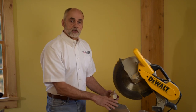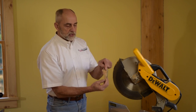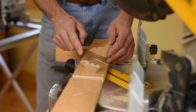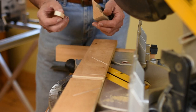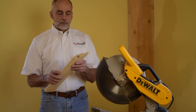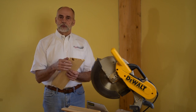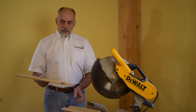Sometimes this is a little hard to visualize because it's a sprung molding. But if we look at this solid crown, there's no difference — if I take this same molding and cut off the back to make it a sprung crown, the ceiling projection is the same: three and an eighth inches. What we're doing by having a sprung crown is using less wood. You can see this is coming out of a piece of four quarter, while this is coming out of a piece of six quarter. That's why crown moldings are usually made sprung — to save the lumber. We have the proper miter cut because we have our stop set up at the ceiling projection away from the fence, so we're going to cope to that line and we know we'll have the proper depth.